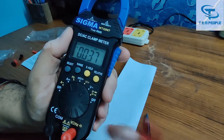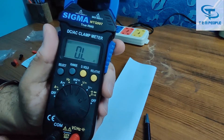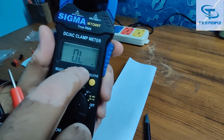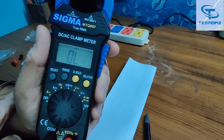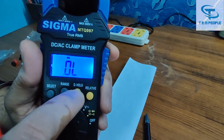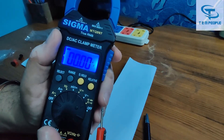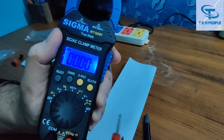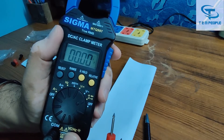There are four modes accessible via the select button. First it goes to the resistance part, then pressing select again goes to continuity, then diode, then pressing again shows 'F' — the farad — which is the capacitance part. You can measure the capacitance value of any capacitor, but before using it, kindly discharge the capacitor first, otherwise the clamp meter will get damaged.